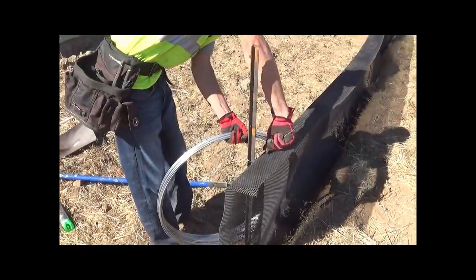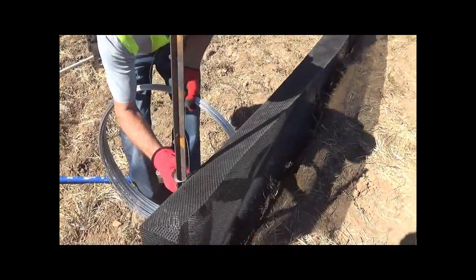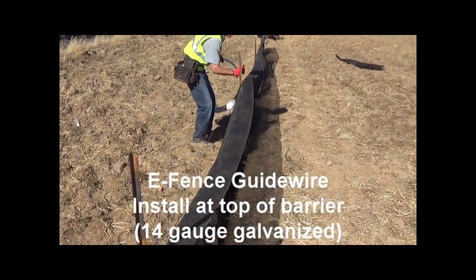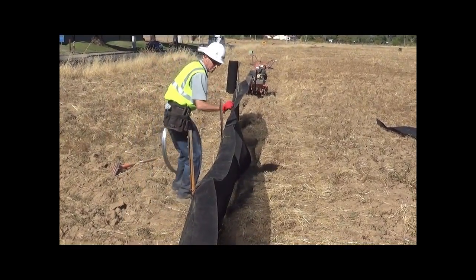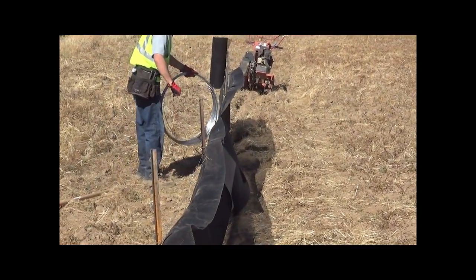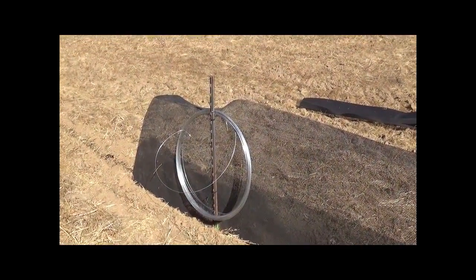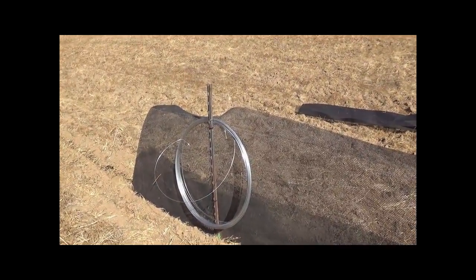Place the wire at the very top corner of the climber barrier and at the very first post wrap it a couple of times, then pull it hand tight around the guide wire. We don't have to tension it any more than that — just pull it hand tight between the posts. Wrap it one time at each post and move on to the next. If the spool gets tangled, cut it and wrap two or three times around the post, then continue. When you reach a T-post where the fence stops, hang the wire on the last T-post until you're ready to install more fence.